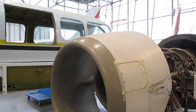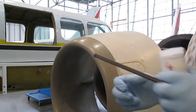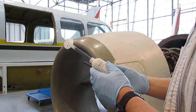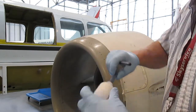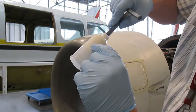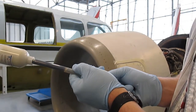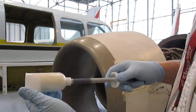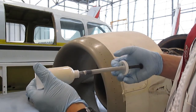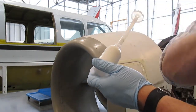I've got a small mix here — this is 870, a corrosion-protecting compound, 870 B2. What I'm going to do is move the mixing tool out so that little pin can pop out the bottom. I'll take my black component and push a little bit in, pull it back a little bit, push a little more in, pull it back — repeating until I'm fully injected.